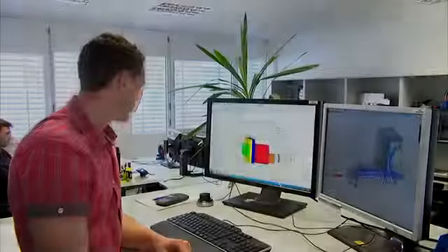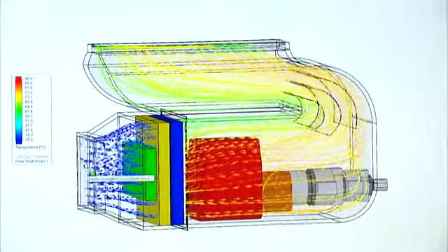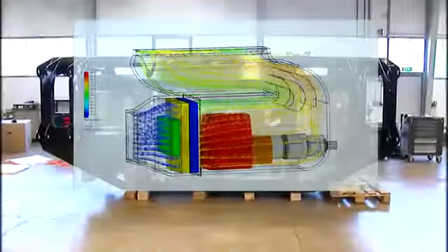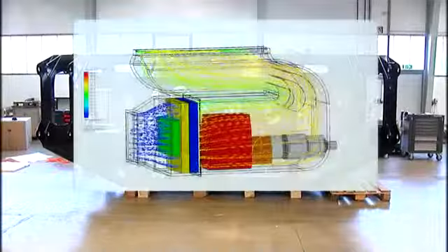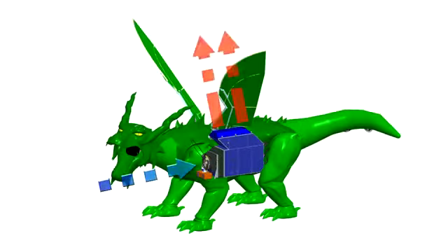The overall concept of cooling was a major challenge. Engine charge air, cooling water, and the hydraulic oil are cooled in the upstream combination cooler. All in all, a cooling capacity of about 155 kW is required to prevent overheating. The engine case not only serves the purpose of noise insulation but also provides a flow passage for the airflow generated by the fan wheel.